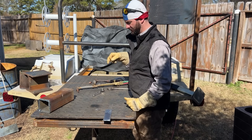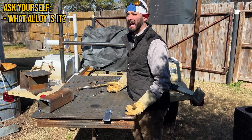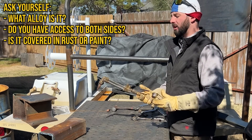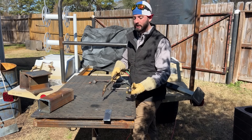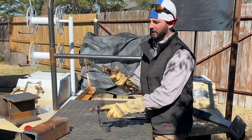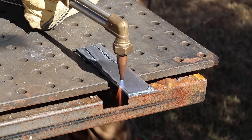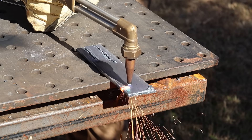Everything up until this point is something you absolutely have to know before you start cutting steel with a cutting torch. You obviously need to know what alloy it is — is it going to be able to cut properly with the torch? Can you have access to both sides? Is it covered in rust? Is it covered in paint? All things needed in order to make a clean cut with this process. The cool thing about this process is it makes really clean cuts on the stuff it's supposed to cut. Traditionally speaking, in order to make a cut on that same material, you would set your torch properly, get that neutral flame, maybe a little preheat if needed, start on the edge, keep more or less a straight up angle, and maintain proper travel speed.